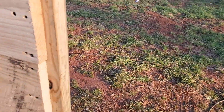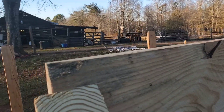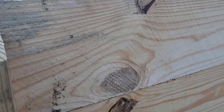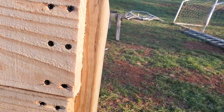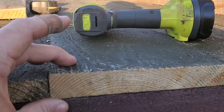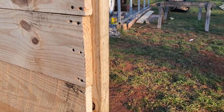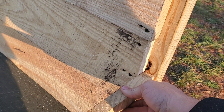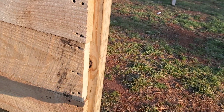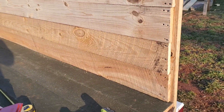As you can see, I left a little bit of space and the line isn't perfectly even. Some of these boards were probably a little longer than eight inches — I calculated them to be exactly eight inches, but some are probably wider. Even with rough cut lumber, some pieces are thicker than others, so consistency isn't always the same. But the tailgate is going to come up into this section here — I wanted the tailgate to stop up against that groove when it closes so it's more stable and not flopping back and forth.